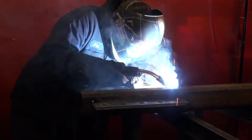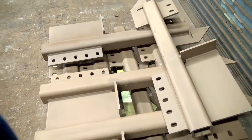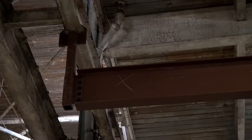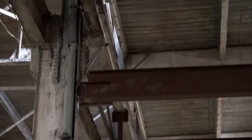We made these stubby columns to carry the beams from one side of the building to the other side of the building, and then intermittent to that we used the columns that were already in place, and we had to weld clips on the columns at a certain height to be the same height as the columns that we installed from the upper beams.